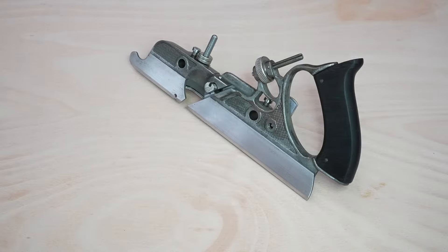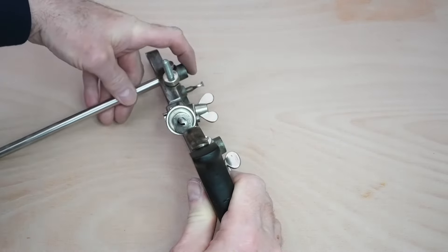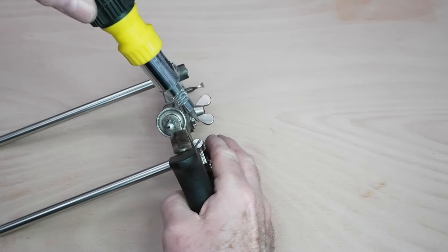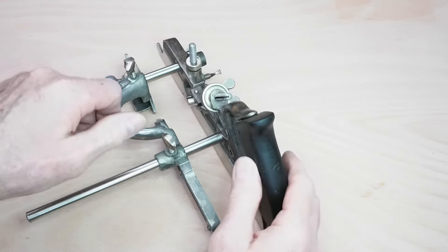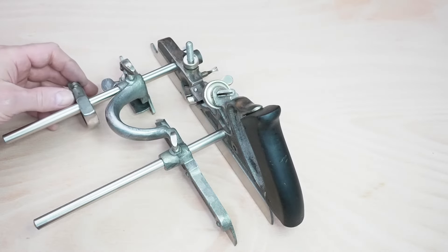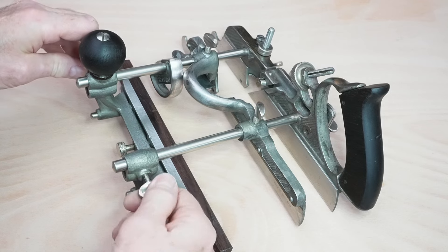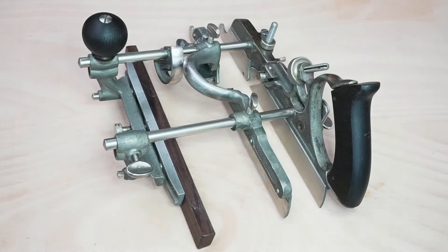Right, let's do a bit of assembly just to see what it looks like. I've installed all the sub-assemblies onto the main stock just for the time being so we can get an idea. The next thing to do is to insert the rods — I'm using the long rods just for demonstration purposes. Now we can slide on the sliding section. Here I'm sliding on the cam steady just so you can see where it goes. Finally I slide on the fence assembly. There are still one or two other components which I've not installed at this stage — those are for special purposes and I'll cover them in the next video. But for now this just gives us a good idea of the general arrangement.